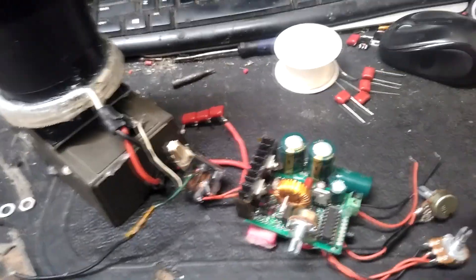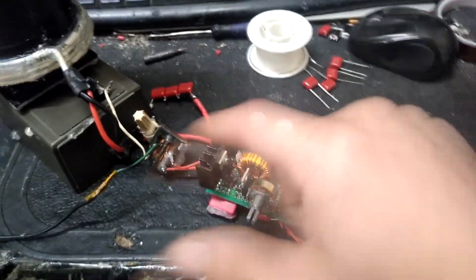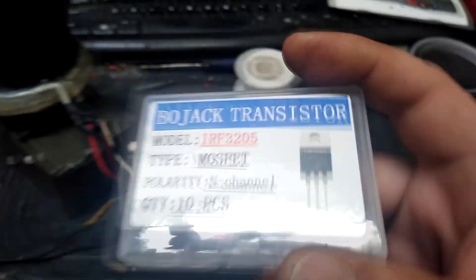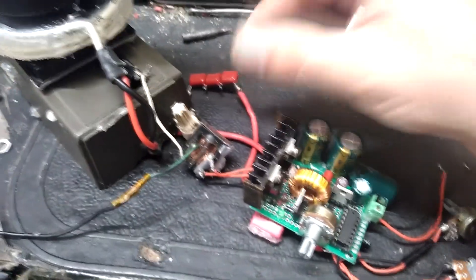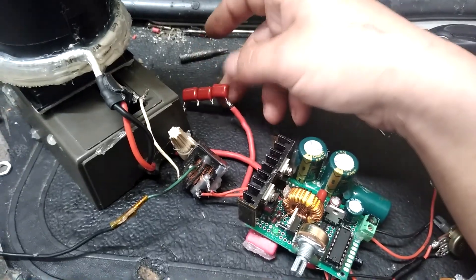I've been with this circuit for about a week or so, and normally it's inside this little container here, but I've been fixing it because every now and then I've been popping these MOSFETs. I've been trying to make it work well with these IRF3205s, 55 volt MOSFETs. What I noticed was, I think my problem was my tuning would drift because these primary tank caps would crap out.